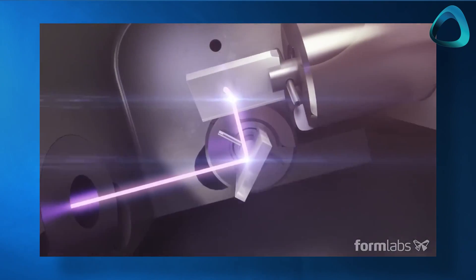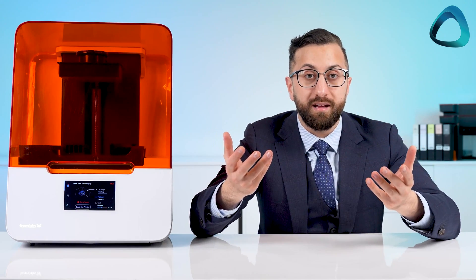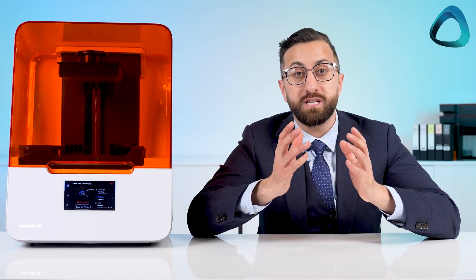Formlabs printers are SLA printers which use a laser to cure each point in each layer during the printing process. This means there's a trade-off between print quality and print speed, which naturally means SLA printers are not as fast as LCD or DLP printers. As an example, it will print a splint or surgical guide in around an hour and a half to two hours, a model in around two hours, and a single crown in about an hour. To help address the speed compromise, Formlabs recently added a fast arch printing mode which can print one model in under 10 minutes and four arches in under 20 minutes using draft resin at 200 microns. This is impressive speed for an SLA printer, but it is restricted to their draft resin, meaning in a dental setting it's basically limited to printing models.